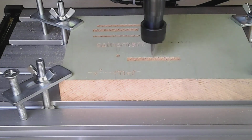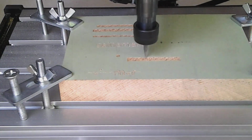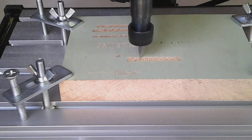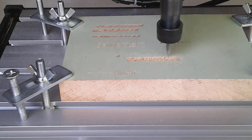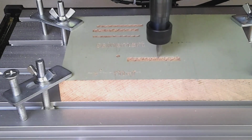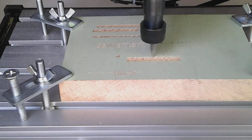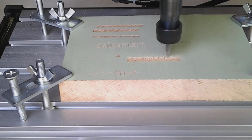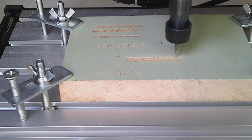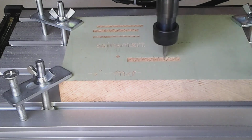Okay, and this is what I learned. 1, check all the screws. I forgot to tighten bolts on one of the step motors, but it wasn't really an issue. But I watched several videos, and each time someone left something loose, I should have known better. 2, the instructions are pretty clear, but only if you're used to using instructions that are presented that way. Some people need more instructions, some people don't need instructions at all. But I found it to be pretty easy to follow. But then again, I did watch several videos where people assembled the machine.